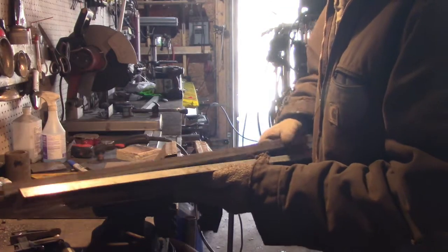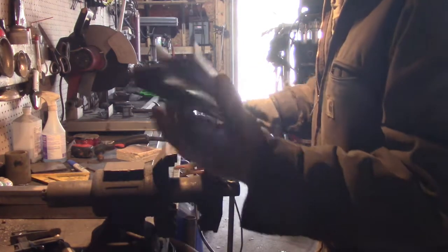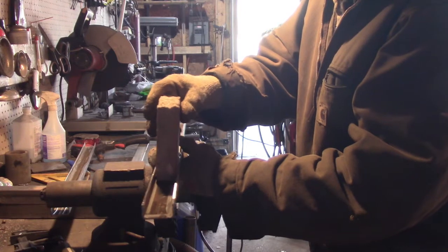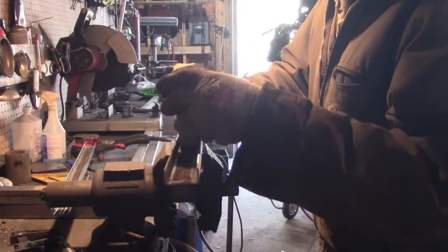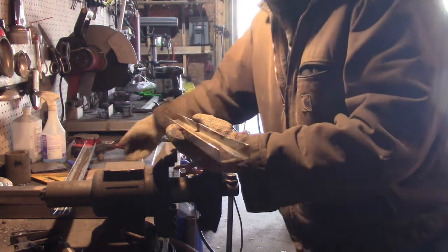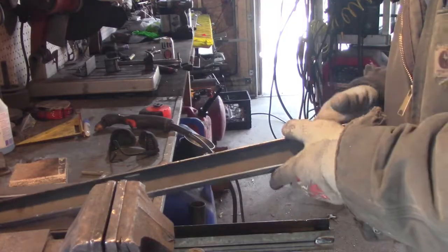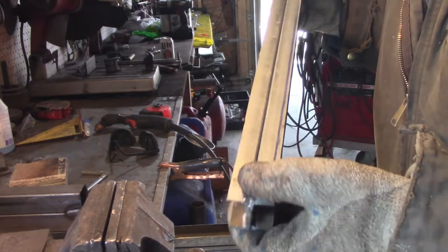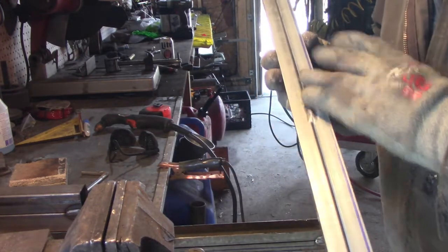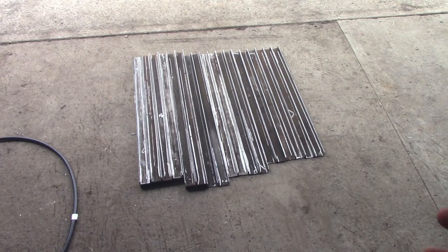What I'll do is flip the sliced pieces around and create an I-beam — clamp them in place and weld them together. A brick slides right in there — it's just a tad loose, but that's intentional since the metal will expand and contract with the heat. There's no way bricks will fall out once it's all assembled. Now I'm grinding the welds down a bit because I'm planning to weld uprights and I don't know exactly where they'll fall, so I want a flat surface. All the pieces are cut, the I-beams are welded — time to assemble into a cage.